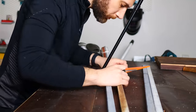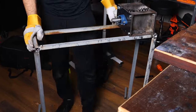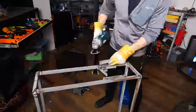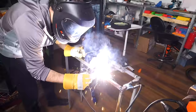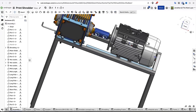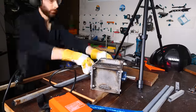The next thing I needed to assemble was the frame, and I admit I was pretty out of my depth. For this thing to work properly the frame has to be strong, sturdy, level to the ground, and built so that the shredder shaft aligns perfectly with the motor shaft. This might be easy if you have the right motor version with mounts on the bottom, but we don't. So I had to use my seriously inferior steel working skills to cut and weld all different kinds of pieces. I actually started by modeling the entire thing in OnShape using models from GrabCAD for both the shredder and the motor, but those models weren't exactly like mine so I decided to just start cutting and welding and figure it out as I go.